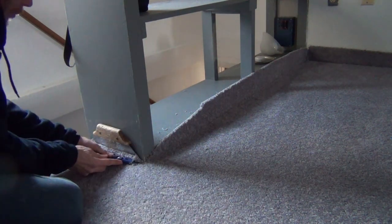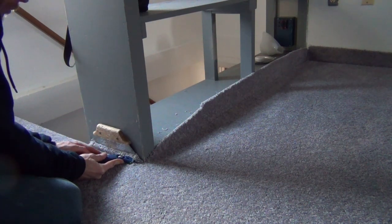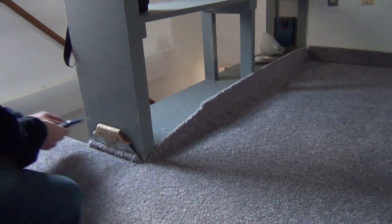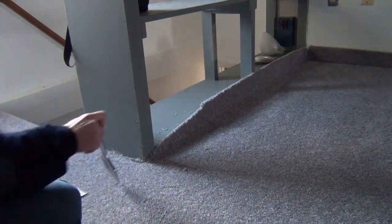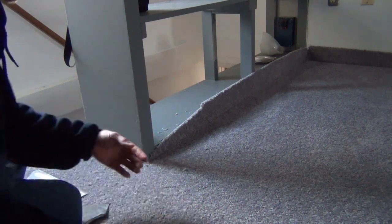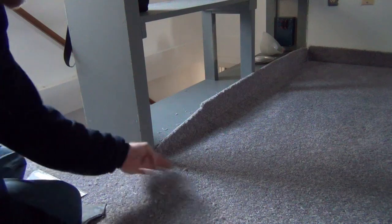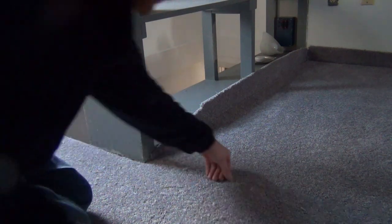And then I can just basically cut a quarter of an inch above the tack strip. This way we can shave that off. Basically like that, and then flip around and just tuck that in there. And I brush my edges away as I go so I don't have to use the hose for the vacuum. But that's one technique that we do there.